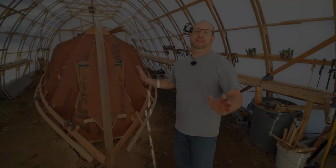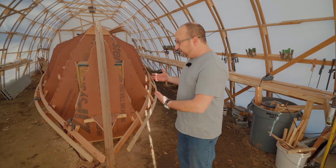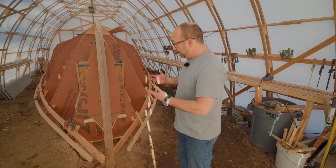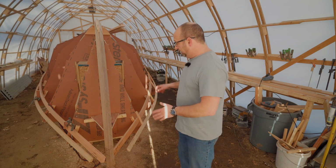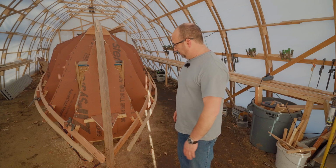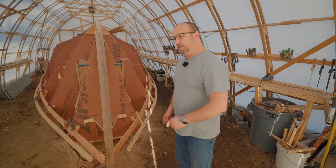Well, I could not be any happier at how the starboard side chine has turned out. It's laying so nicely across the station mold notches with just a little bit of shimming to put the right amount of twist in, and really moving those notch locations was surely the way to go. And I'm going to say it was 67% skill and then two-thirds luck.